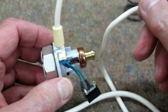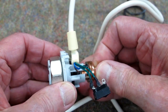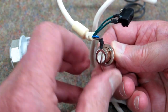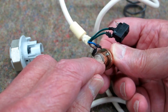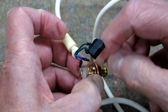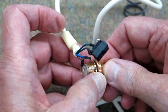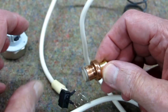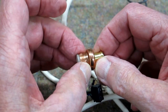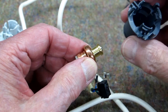Here we have the wax motor, and we can pull that out. There's a spring-loaded contact that makes connection with this piece, and this ring connector makes contact with this copper piece up here. And that is the wax motor. So as that heats up, it expands and pushes up on this mechanism.